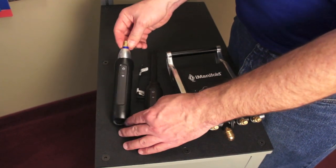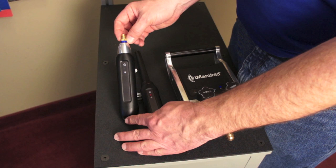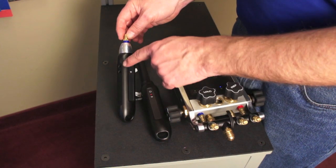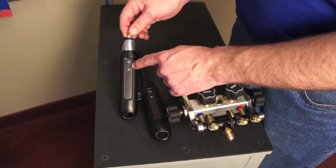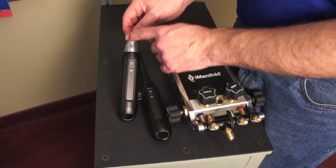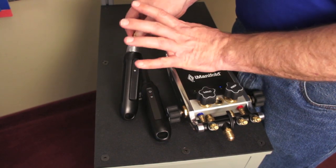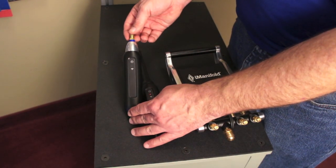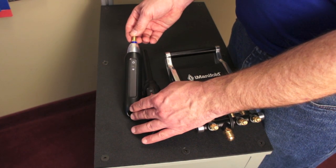The other probe we're working on is the pressure probe, which will come in high pressure and low pressure versions defined by the color of the tip. Like the wireless probe, it allows you to measure two temperatures and has USB power on the side. It will also allow you to measure superheat all by itself — because we have temperature and pressure, we can calculate superheat, and with the other temperature probe on the side, measure box temperature. If you're doing supermarket cases or setting up supermarket refrigeration, this lets you measure pressure and temperature simultaneously, making setting up an expansion valve very, very quick.